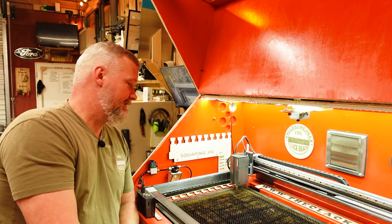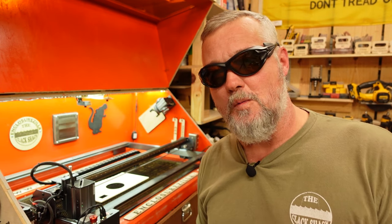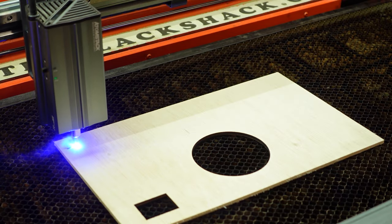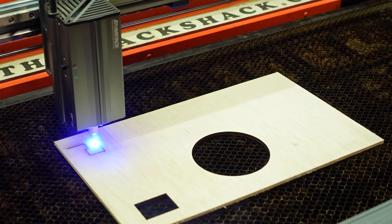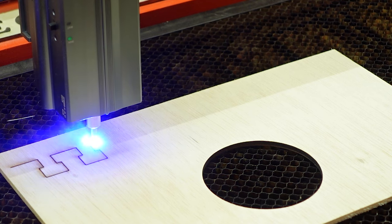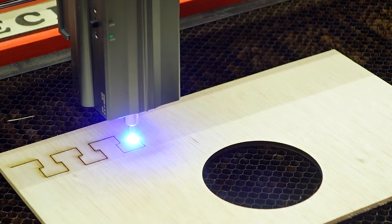I've intentionally sabotaged my air assist to show you how easy it is to readjust it. I'm going to get you closer to the laser. Right there you can see — that's no air assist. I'm going to let it run this one little tab and start walking the pressures up, slowly turning the knob clockwise to increase pressure. See how dark the line around that cut is? I'm trying to make it get more faint. Right there — you're starting to see some effects from the air assist. See how much cleaner the cut has gotten?